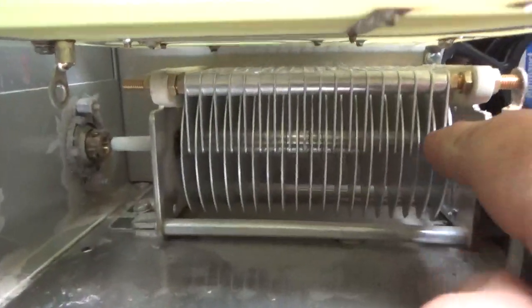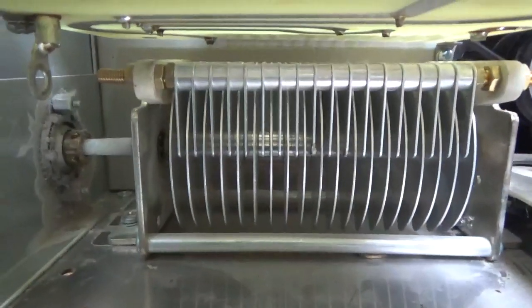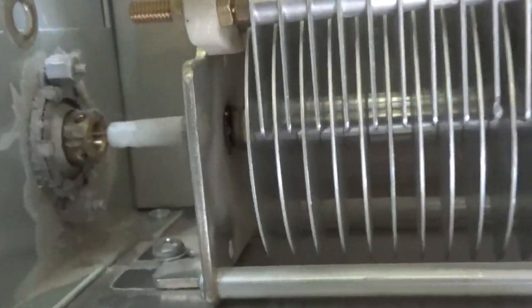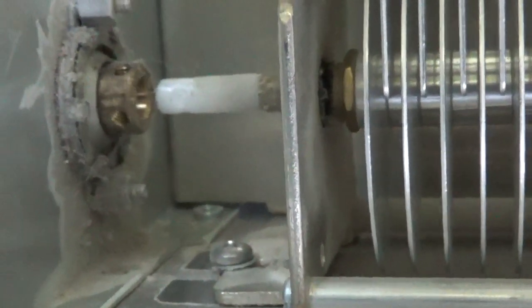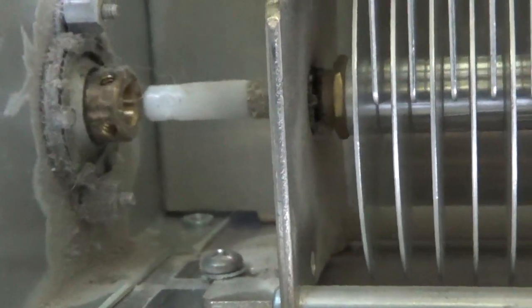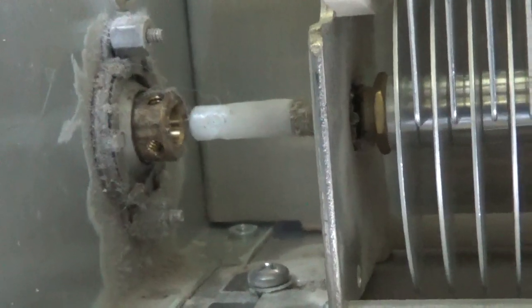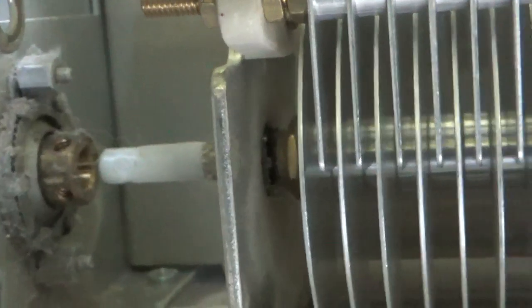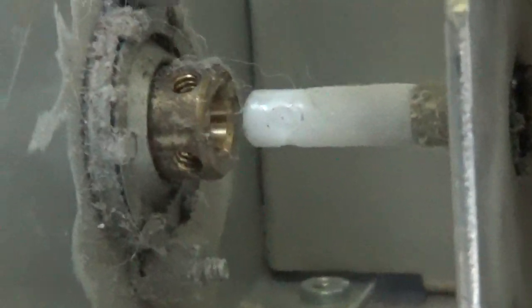Taking this cap out — the shaft was at a downward angle, so it was putting pressure on the vernier reduction drive, chewed up at the end. Because of that, there was wear on the balls inside of it, so I'm going to replace that. You always want to slip the shaft in, leave those standoffs loose so you can slide it up and down, slip it in, and then secure the capacitor to the chassis with the two screws, then secure the screws on the vernier reduction drive.